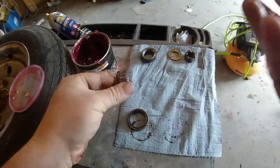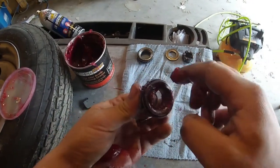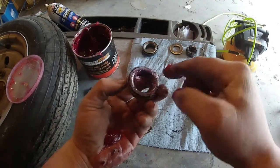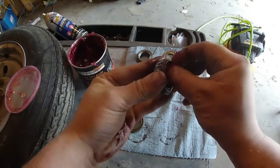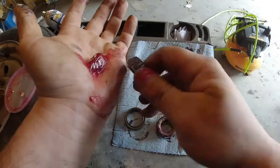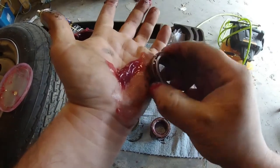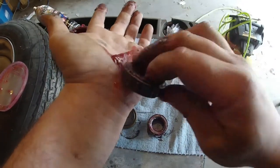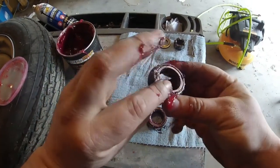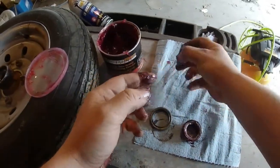What you're looking for is new grease all the way around the inner and outer race. You can put a little bit on the outside, but the key is new grease all the way around. Spin it to make sure you get grease in there and keep going. Do the same for the front bearing — again you're looking for grease all the way around. Give it a couple of spins. Alright, that's good.